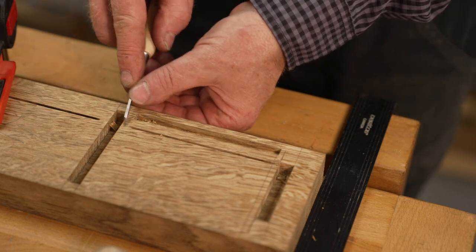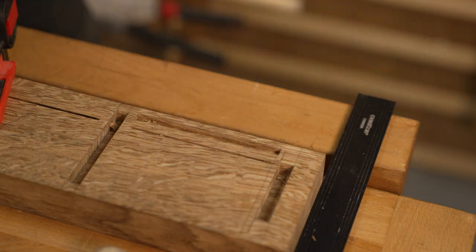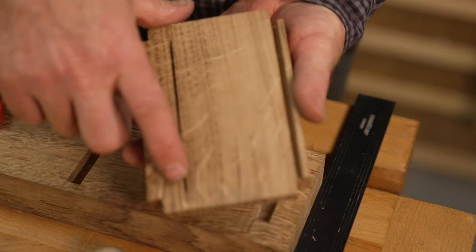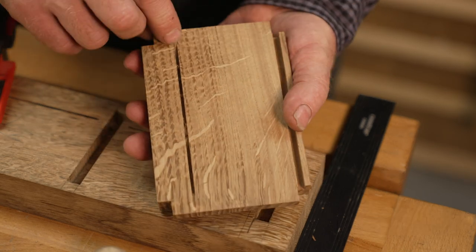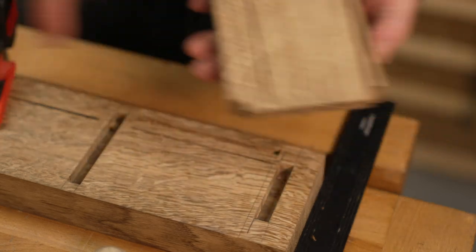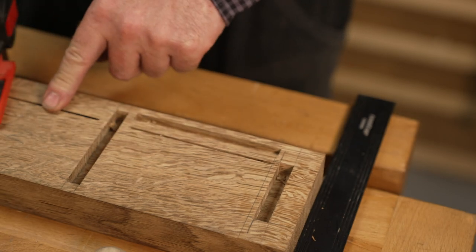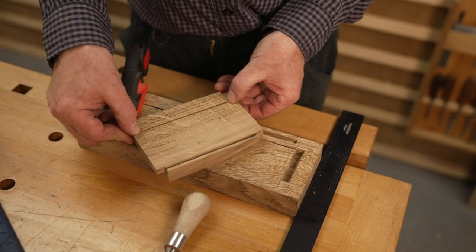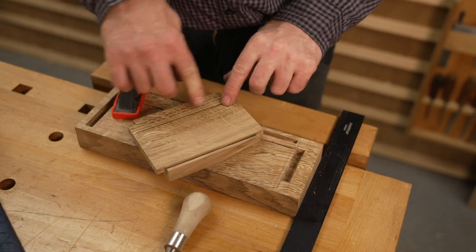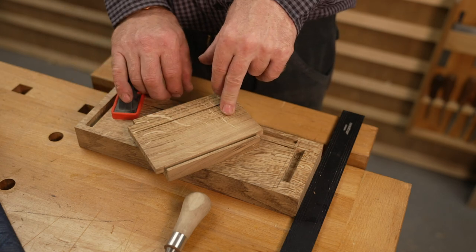These ones again, I can come up to the middle, square up the corner here. We've also got a little bit just to nick out on the corner ends. This is the chop, so we want a little bit more off there. The chop is going to fit down in here to make sure that it comes deep enough to where that panel's going to line up. All right, so those corner points on these will need a little bit of work as well. Do the uprights first, then these. All done. We'll get you back in when I finish playing with the hand chisel then.